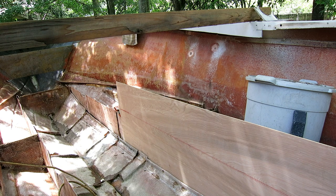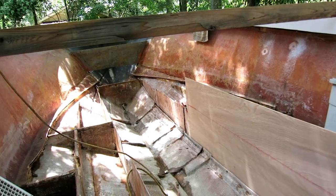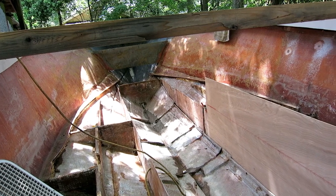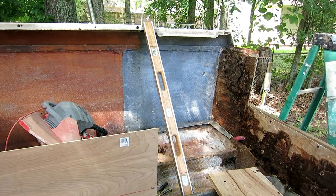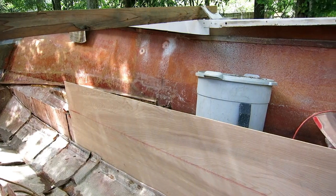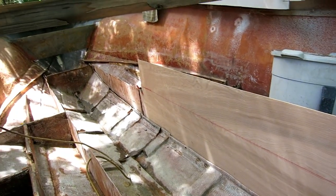I've never seen the boat in the water so I don't know how it floats. The worst thing that could happen would be water ponding on the floor in the front and not draining to the back - that would be absolutely the worst. I'm thinking about raising the front a little bit, gaining maybe an inch higher than a projected line would normally be. Back in the back, the chalk line shows the original floor is quite a bit higher than the two scupper holes that drain the back deck.